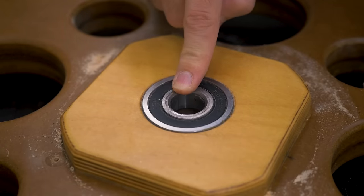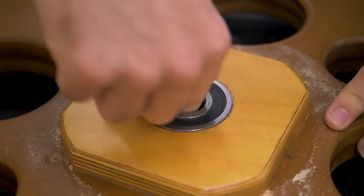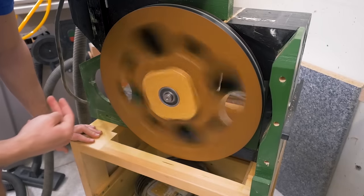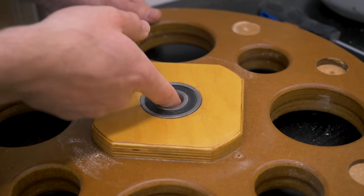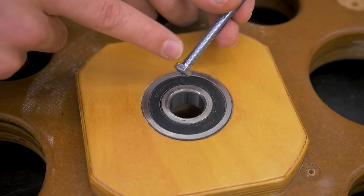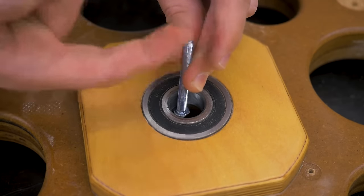But another thing I noticed is that this bearing is completely garbage — there is nothing but resistance in it and you can hear that quite clearly. I definitely need to replace that, but that won't be fun since this was never intended to be replaced. It might work with some M6 bolts, because the head can kind of hook inside, and then I can pull it out with a nut from above.